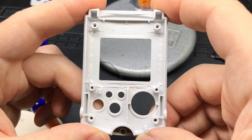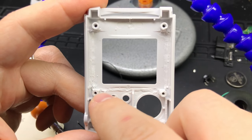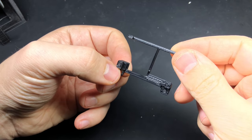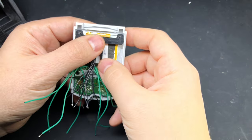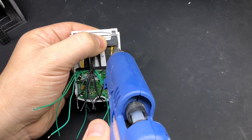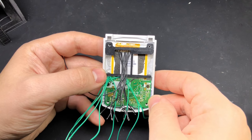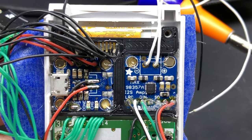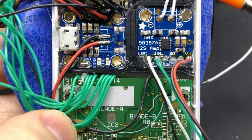For the case, you'll need to pull out your Dremel and cut some of the insides out — make sure you cut down to about where I'm pointing so the whole screen can fit in there. To make it easier, I designed and printed a custom part that will line up the screen for you and give you a couple of nice places to put your battery charger and soundboard. You can just place your screen in there, glue that part in place, and here you can see what it looks like after you put the battery charger and soundboard in there as well.